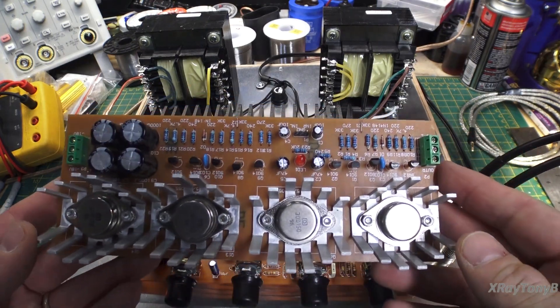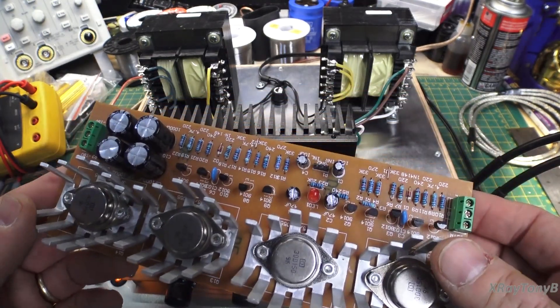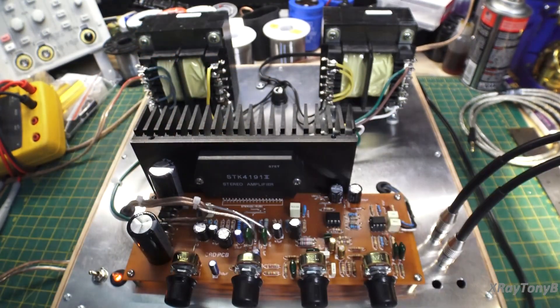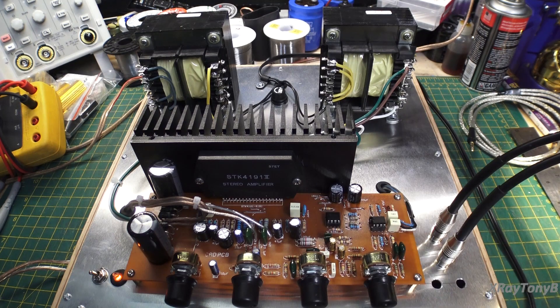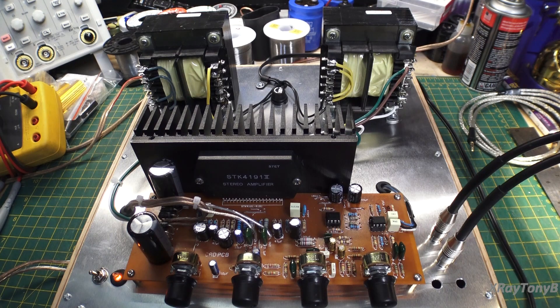Comparing this to the quasi-complementary kit — that was a big-time fail. It doesn't have a preamp, doesn't have tone control, had terrible bias problems, lousy heat sinks — not very good altogether. This kit, on the other hand: yes, you had to provide a heat sink, and everything else came with it. You could use the stock capacitors that came with it and it worked adequately, although putting better capacitors — like Kemet film caps from Mouser and good Nichicon electrolytics — did improve the sound by tightening up the bass. I'm still searching for that perfect kit, but this one is definitely a significant step up.